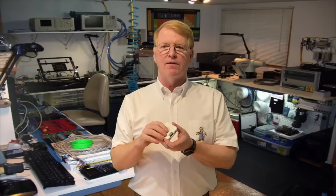There's a little USB plug in the back, and we supply a short cord. You plug that into your Macintosh or your PC, and a folder pops up on your desktop — that's the folder where the sounds reside on the sound controller. You just drag and drop the sounds onto that folder.